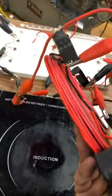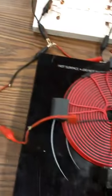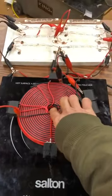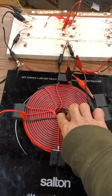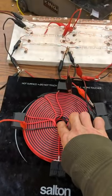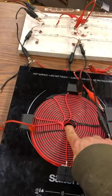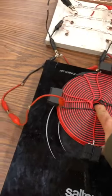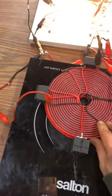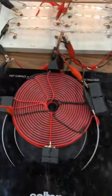That's the whole coil — I'll pick it up for you. There's nothing to it; it's all glued together. I've disclosed everything about it. I'll just set it on there and instantly it picks back up. I'll demonstrate moving the coil to show you the tuning for balance. As you can see, there's a bright spot — two bulbs are brighter and four are dimmer. Depending on where you place the coil, it works throughout quite a range. I found the best position to be somewhere back here where the load is evenly balanced.